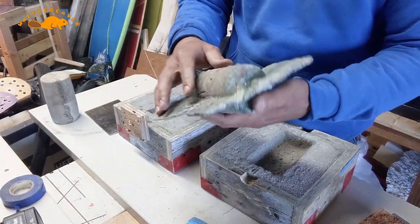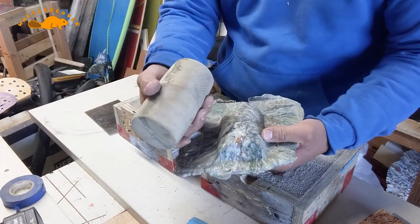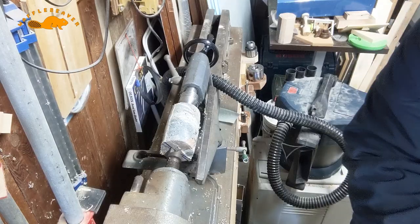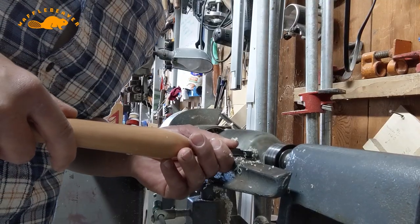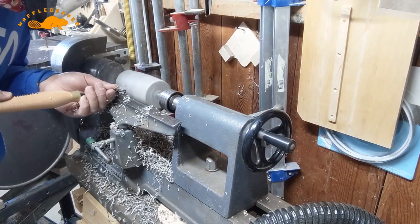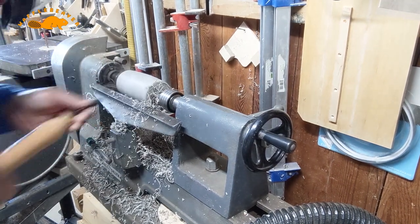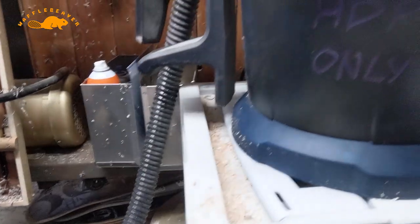You can see a little bit of the bubbles, but for the most part it feels like a pretty heavy mallet. I cut off the squeeze-out before I chuck the plastic mallet head on the lathe and start cleaning it up. Turning plastic is fun — it feels like a great material to turn as someone just beginning to learn the lathe. These mallets do have some air bubbles, but they're small, and turning is one of the quickest ways to feel an air bubble in a plastic melt. The concrete mold does a couple of things well: it can handle the heat and take the pressure required to compress the plastic into the desired shape. I try to recycle any shavings and bits of plastic — these small shavings are also easier to melt — and this vacuum is dedicated to recycled HDPE.